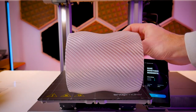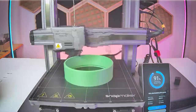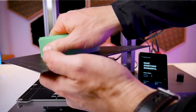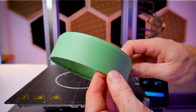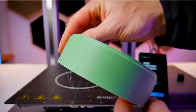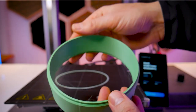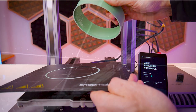For those lenses I was conservative about print speed but within an acceptable range. I then switched to a polytera green PLA. This print went well although the brim severely stuck to the print bed and was a huge pain to remove. There's some fine stringing — I'd need more fine-tuning per filament — but I slowed this part down and the walls came out a lot nicer. I had to pick and scrape the brim off with a razor blade, which isn't the safest and is very tedious. I ended up causing some minor damage to the flex plate itself.